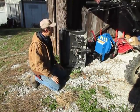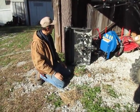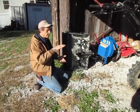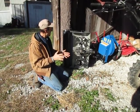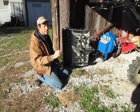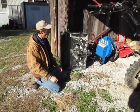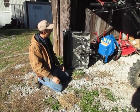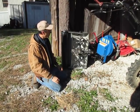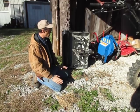So that's one thing you can do. Of course, you can't mitigate the fact that the tiller mixes the layers — it's always going to mix the layers. The depth roller allows you to minimize your depth very precisely. You can set this thing a half inch deep if you want. Obviously, if you're only working the top half inch to take off a few weeds, who cares if it mixes that little layer of soil. But when you're working three inches deep, it's going to mix all the soil layers within that three inches — there's just nothing you can do about it.